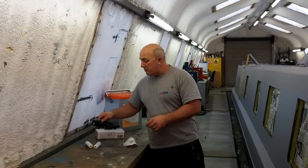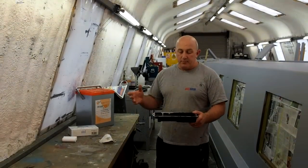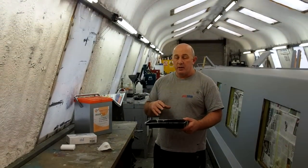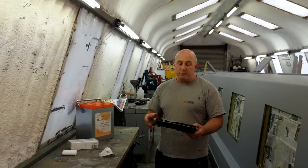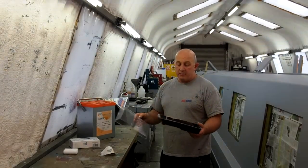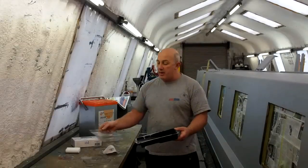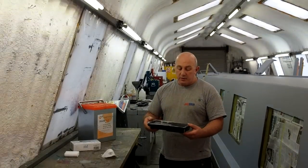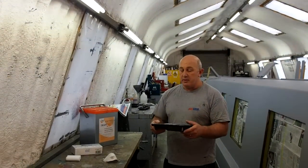A little tip: apart from the rollers, you're going to be using roller trays. When we get on to undercoats, glosses and so on, we'll either be using roller trays or decant paint into a wood container. Try not to paint out of tins — anything you pick up on your brush you'll be putting back in the tin every time. So decant where possible. To save on having to continuously wash out trays, especially as you're using lots of different colours, you can buy these little insert trays — works a treat. You can swap to another colour by just popping another tray in. The tray acts as a paint kettle — we're decanting into it so we're not cross-contaminating tins with paint.